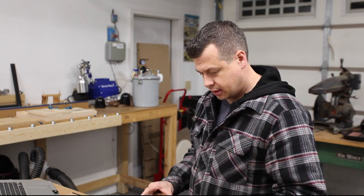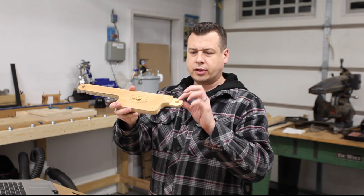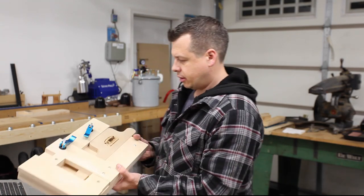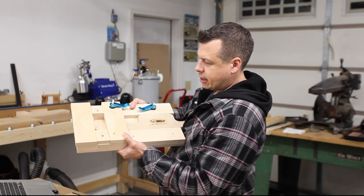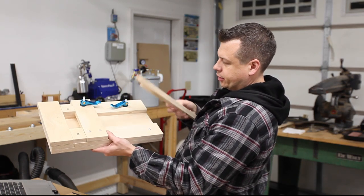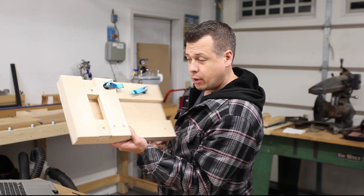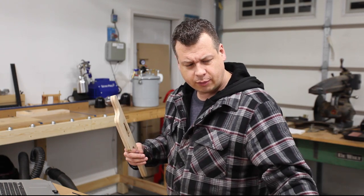Once I had all those cut out, each board has a stair step on both ends. To cut those stair steps, I made this jig over here. You slide the template in, these cam clamps lock it down, and your router rides on this area right here. You cut that out, then flip it over, stick it in, and ride out the other one. This is not my secret weapon — it actually helped a lot, but that's not really what this video is supposed to be about. I feel like you needed this background in order to understand the process.